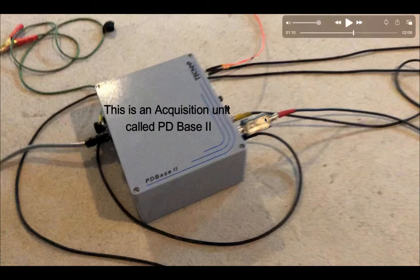Here one more thing you can see is a high frequency low pass filter, because we realize there is a lot of high frequency noise and we want to cut it using this hardware filter. Of course we can also do this with our TF map, but doing it in hardware allows us more space to work with the TF map, which you will see in a second.